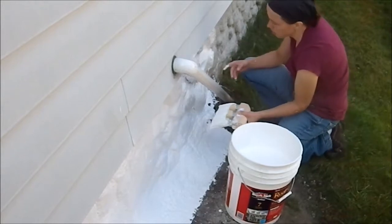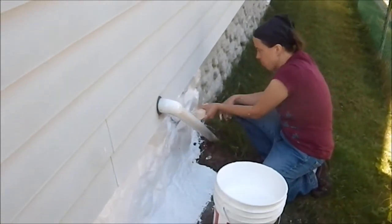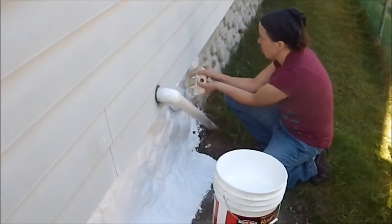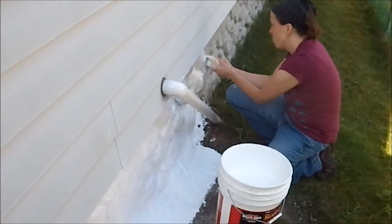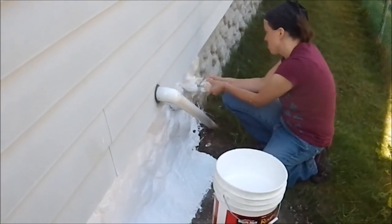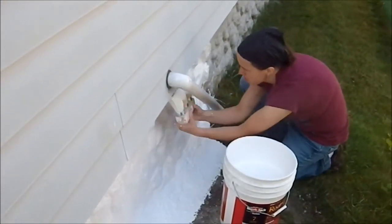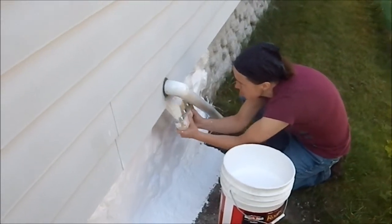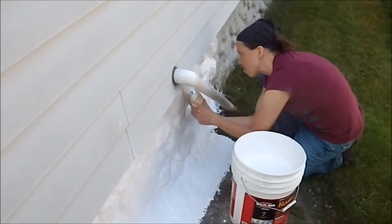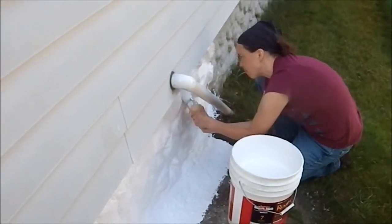I won't claim success until we have no alarms until October. Yeah, that's our goal, because we were getting them in August and September every year. So now we're trying to get it to the point where we don't get any at all. One o'clock in the morning. Right, when you're sleeping, whether I'm daytime sleeping or Lara's nighttime sleeping, we were getting alarms going off. There's no fire, but you don't know that, of course. And everything goes off in the entire building because they're all wired together. Because this is an apartment building, all of them have to be hardwired, and all of them have to be both carbon monoxide and smoke detectors.